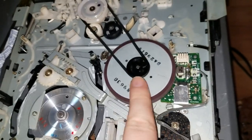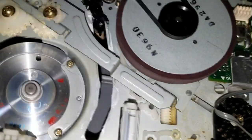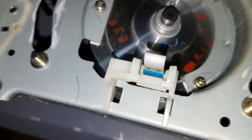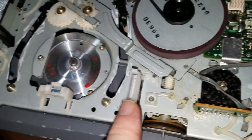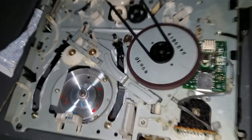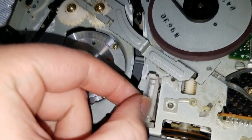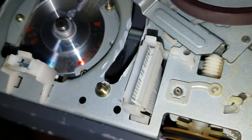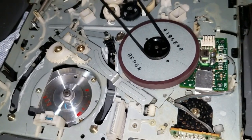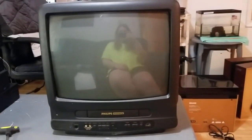All that I need to do now is install this back on the PCB, and this is the part where I have to be really careful because I don't want to damage these flimsy, flexible ribbon connectors that slot into connectors on the PCB. What a stupid design. Not very serviceable at all. Really dumb considering how serviceable the rest of this mechanism is, but Funai used these really terrible semi-flexible connectors that you just have to blunt force push into the connectors on the board. And if you're not careful, you can damage them. Really stinks. Well, she's all back together now.